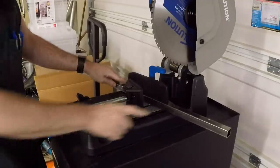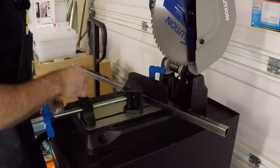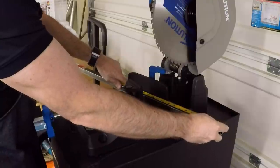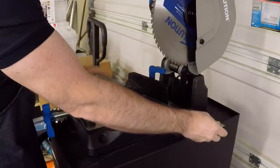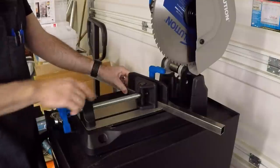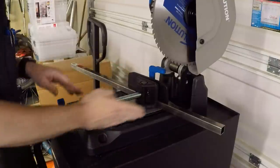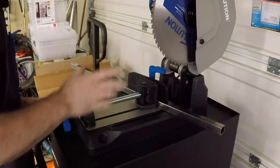Okay, for the mast, I'm gonna cut a couple of pieces of this 1-inch square tubing. First one's 9 inches, and it's not a real fussy measurement, so this will be close enough. Easiest way to cut this stuff to length, especially when you need to miter it, is the Evolution cold cut saw. I love this thing.